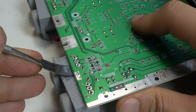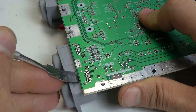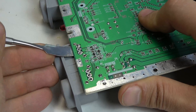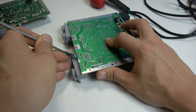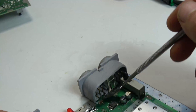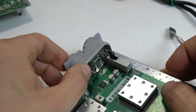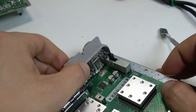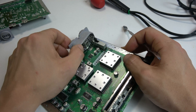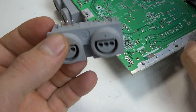After you've desoldered the solder off with whatever tool you choose, it's always best to try to wiggle or pry whatever it is. Another technique is taking the pin and wiggling it back and forth inside the hole, and sometimes heating it up to break any tiny drop of solder still holding it. Then wiggle it back and forth using some sort of pry bar — be careful here because you don't want to damage the board or your component.